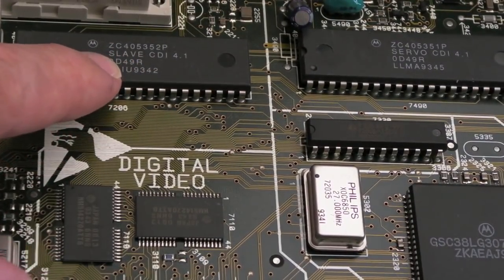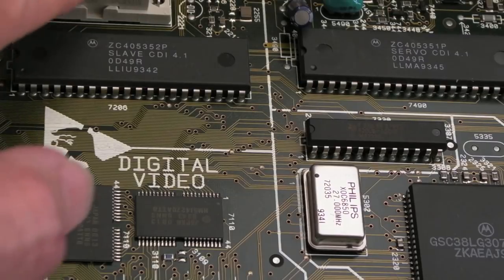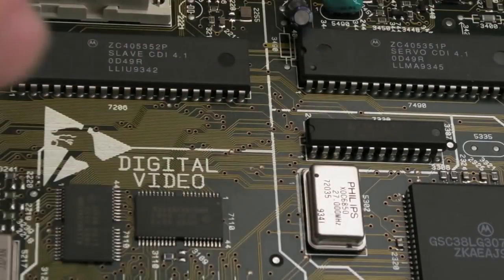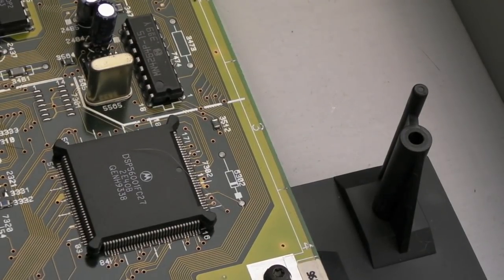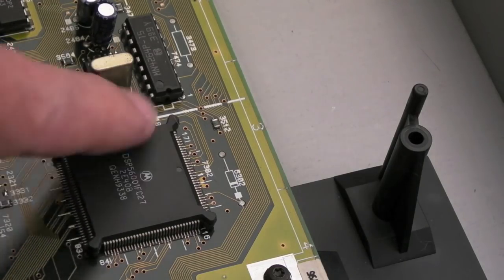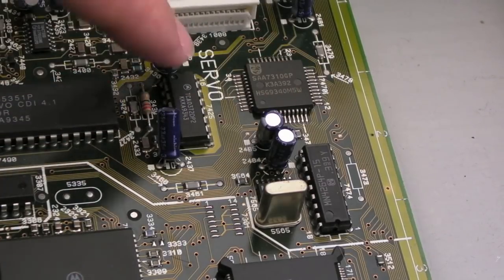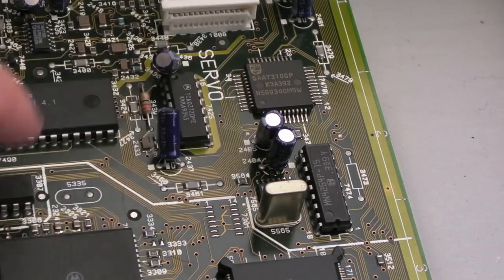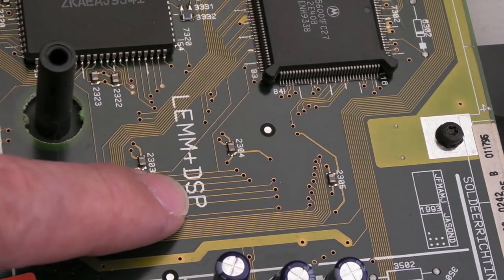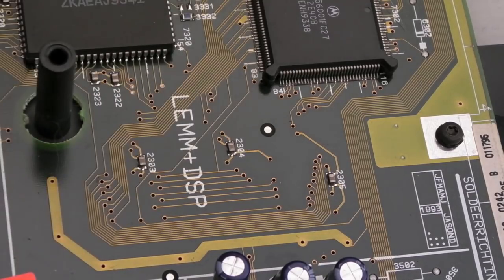So your SCC 68070 is down here — as mentioned in the previous video, it's a 68000-based processor, but there are some subtle differences, and it runs at 15.5 MHz. I think your high scores and things get saved in there as well, I'm not entirely sure. Philips chip there — no idea what that is. Other than the real-time clock chip and the SCC 68070, I'm not familiar with what anything else is on here — it's all pretty much bespoke to this. That says 'Slave CDI' — something to do with the interface. This one says 'Servo CDI' — that's for your CD control logic. We've got handy markings on the board: Servo control stuff, and down here we've got LEM and DSP — one of those is your LEM memory manager, presumably, then your DSP. There should be some RAM on here somewhere.